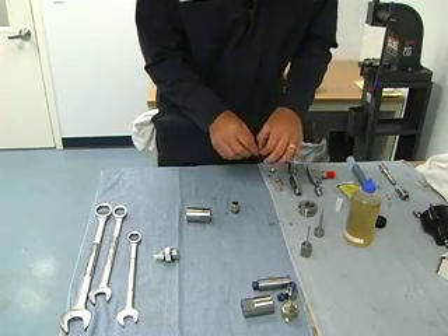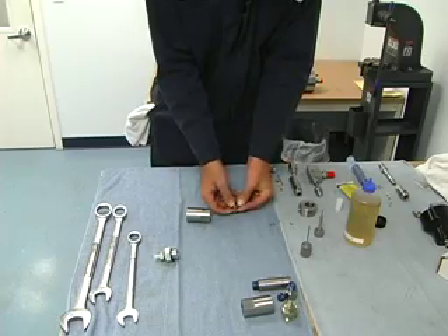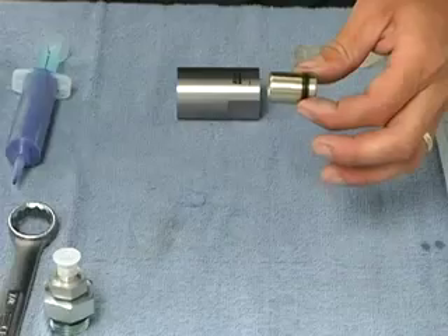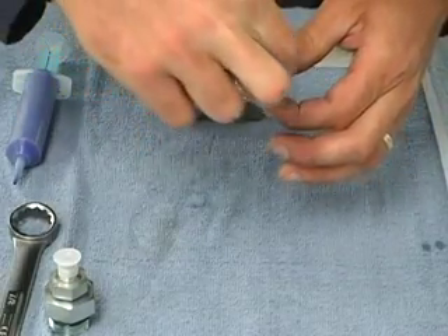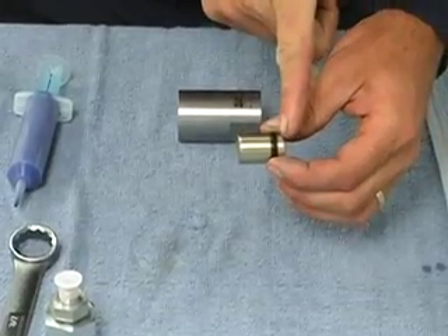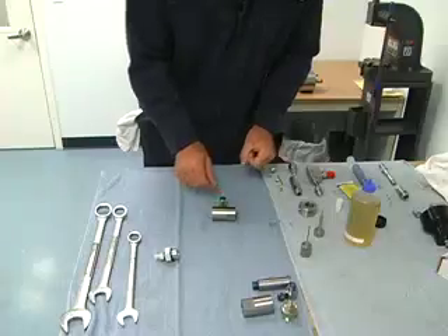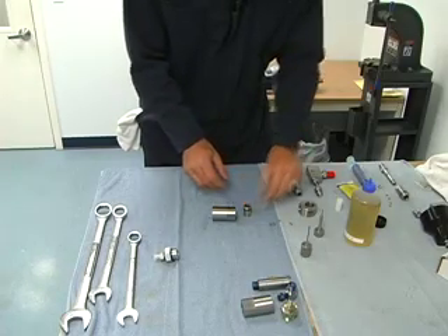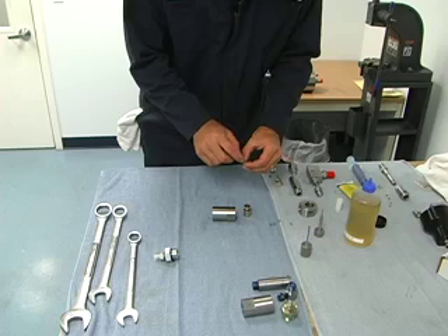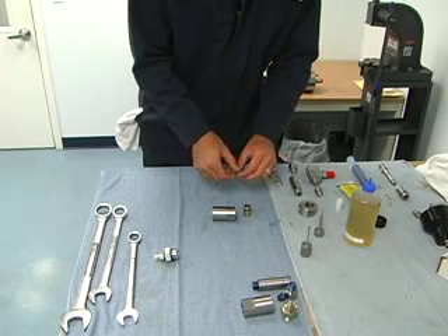Hydraulic oil on the O-ring and slide it in — it's going to go into the barrel. So the oil will be coming from this side, and we need to make sure that the backup ring is over here. Next we have a piston insert, and this is a harder steel so that when the poppet rides on it, it doesn't wear out as quickly.